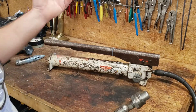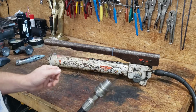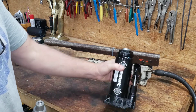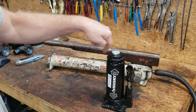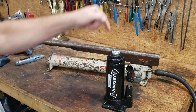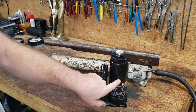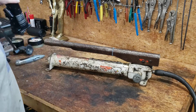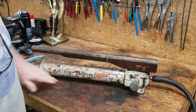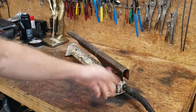What I bought this for was to manufacture a diesel injector pop pressure tester. You can use a bottle jack — I did buy a cheap one recently — but you've got to modify those things: take the nut off, take the guts out, weld on another fitting on top or tap it, and repurpose the port on the side. I don't want to do that. This pump is very sturdy — it has four feet — and it already has a hydraulic port on the front, so there are no modifications needed.